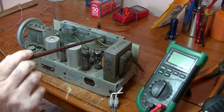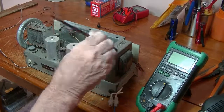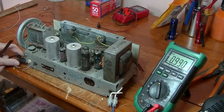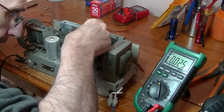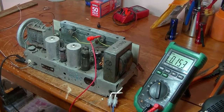First thing I'm going to do is determine, does the power supply work? No point in changing any capacitors if this thing isn't pumping out three different types of voltages. So the first voltage, and I find the easiest to look for, is the 6.3 volts that go to the dial globes. So for that, grab my multimeter and attach my black lead to the chassis. Hopefully I'm getting a good ground on that. Positive will go onto the positive or the active of the dial globe, and I have plugged it into my current limiter.